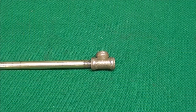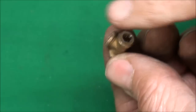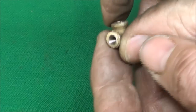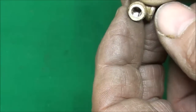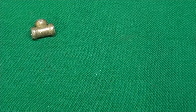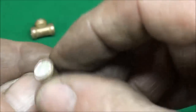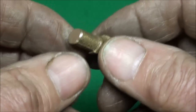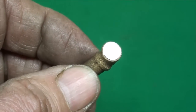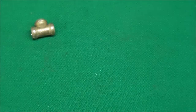Back to the little T — in fact, it is done. On this one I never did face or machine any of those three surfaces; those were just belt sanded. It doesn't matter, but I could go back and do that if I wanted. Now I wasn't going to carry this any further, but I believe I will go ahead and machine the 45-degree L — just a little bit different procedure than the 90-degree, although a lot of similarities with a few differences. I'm going to leave that stub on there; I did that on purpose when I cut it from the stick. Some people say this is a stick of casting, so I don't know which is correct — maybe both.